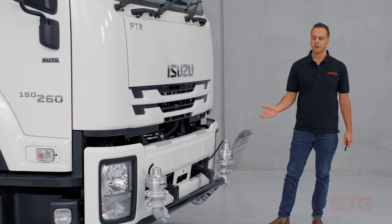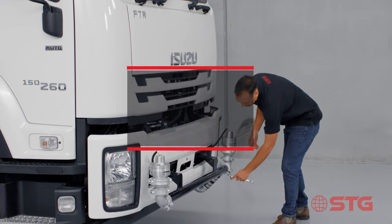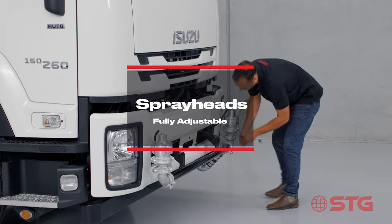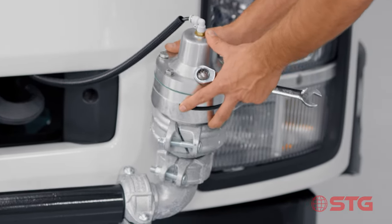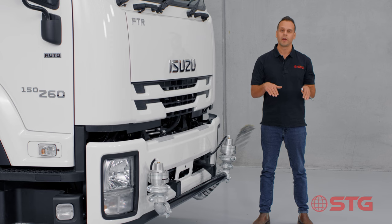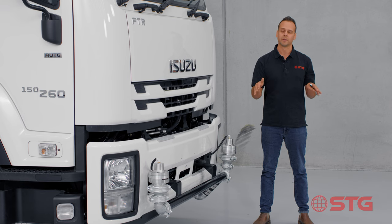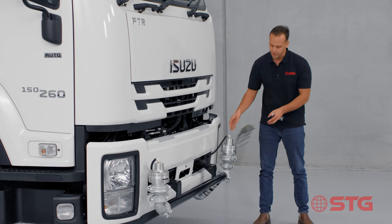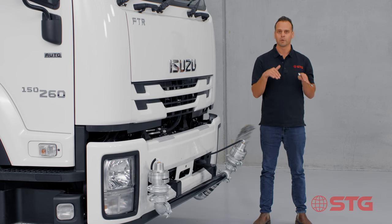What I'm going to go through now is our front road sprays - this is an option we do on all our trucks. One of the really exciting features about the way we design them is that all you need is a 15mm spanner to change the spray pattern. You'll have two applications: spray head high gives a flat spray pattern for dust suppression, or facing it down gives a strong stream for road washing.